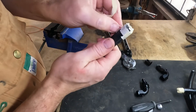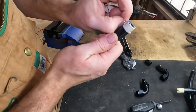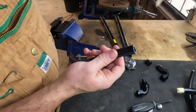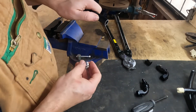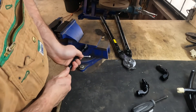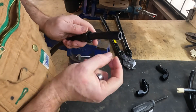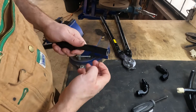We'll remove the masking tape and start on this end. The first thing we need to do is take off the black outer layer, but before we do that we're going to slide our nut onto the hose — because once you take the black off, the stainless steel is going to flare, and when it flares you won't be able to fit the nut on.